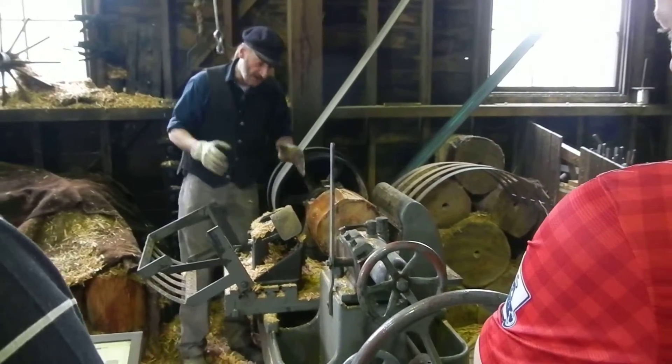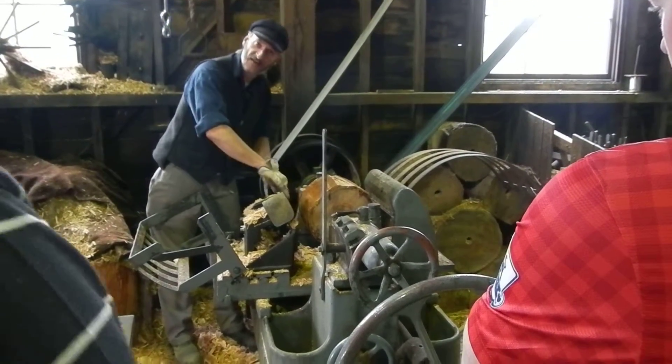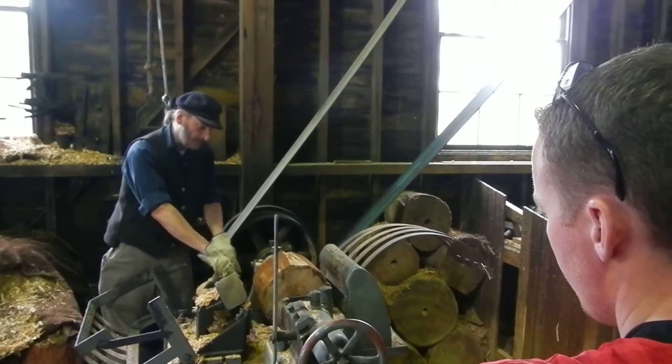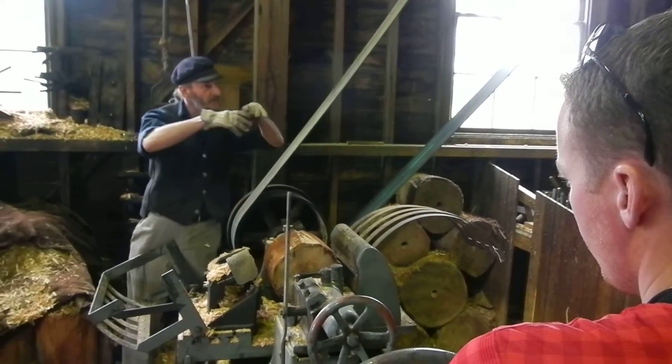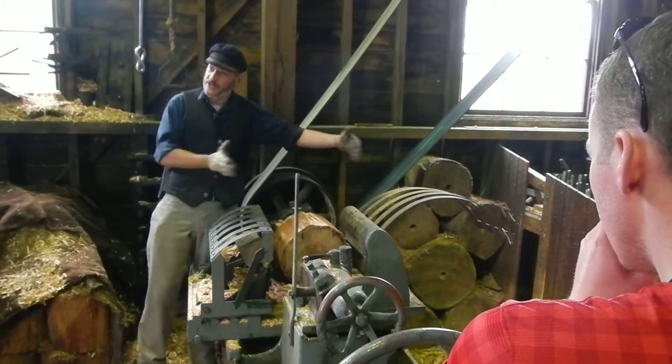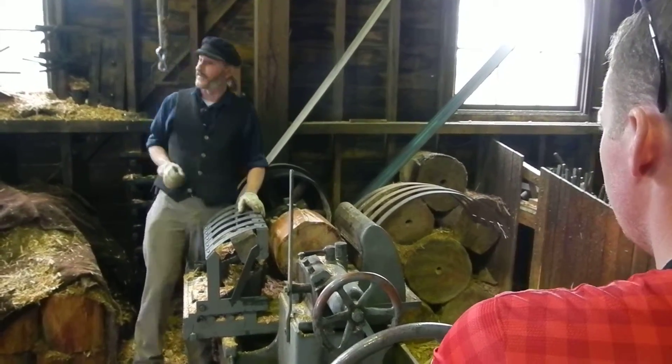After we've got that cylinder, we've got four profile cutters over this side. The lower pair cut it to length, and the upper pair touch that surface, giving our nice curved hub shape. They're both mounted on a carriage that winds back and forth, as you'll see in just a moment.